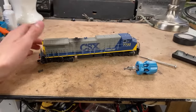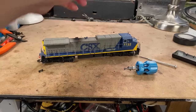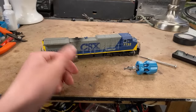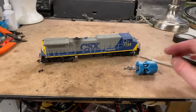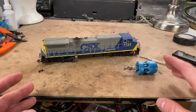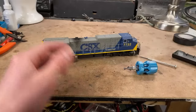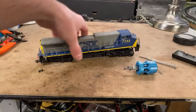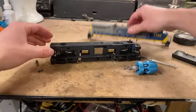The locomotive doesn't move, it doesn't make sound, and the light does not turn on. Okay, well, I would check the wiring. I would check all the contacts, check the wires. Always give the wires a slight pull, because sometimes a piece of solder can crack and power can't flow through it, but it appears okay, so just go through it. That is a textbook electrical problem.